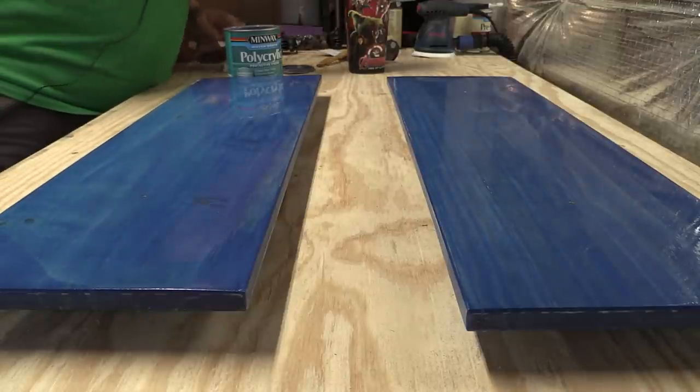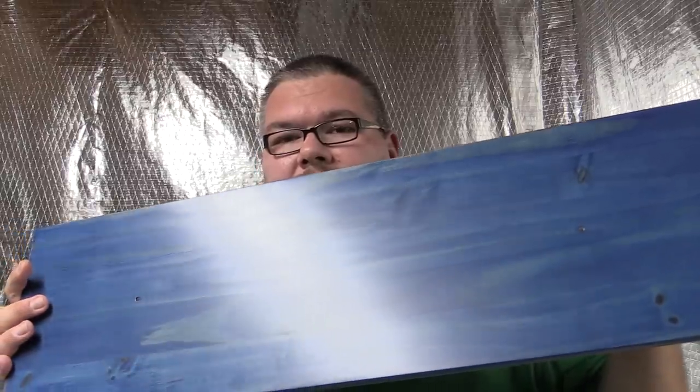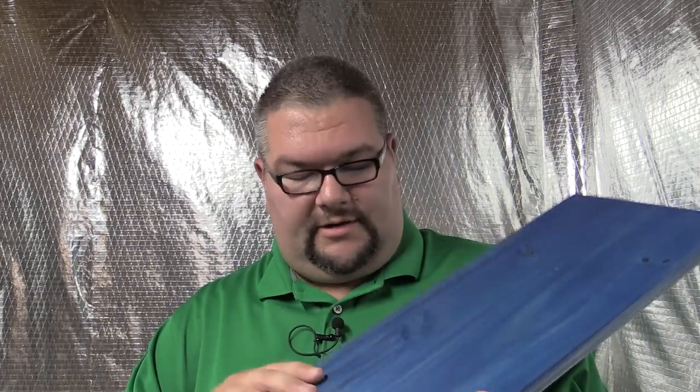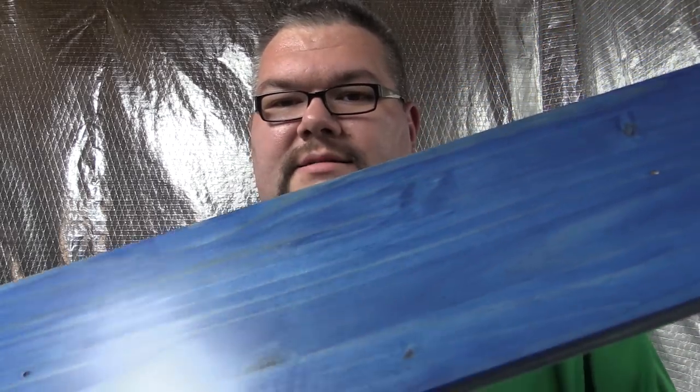I really am learning a lot between coats. Here we are after our fourth and final coat of the finish on the wood. You can see that brushstrokes aren't really visible and the overall surface is smooth enough for my purposes. I probably could go one more coat because there are some imperfections, but you can see where the final finish was kind of sunk into the wood, and there are a few spots where imperfections of the wood still show up as low areas. But overall, for the level of shine I want on this, I'm pretty happy.